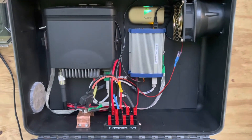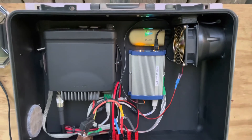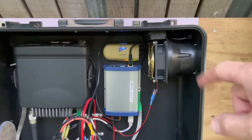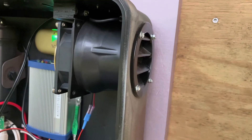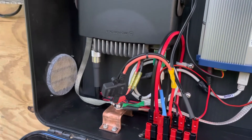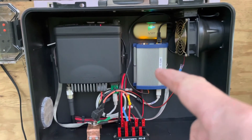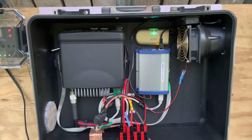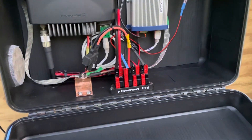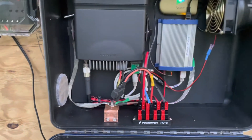Let's talk about the airflow and how we're managing the heat buildup inside the box. We have a 12-volt computer fan with a plastic shroud connected to a vent on the upper right side of the box, and at the lower left we have an intake. Air is drawn in from the lower left, comes through the box across the heat sink for the radio and across the TNC, then pushed out to the outside. So far this has been working very well. At the bottom we have our power distribution block with Anderson power poles, and a ground lug with everything grounded inside.